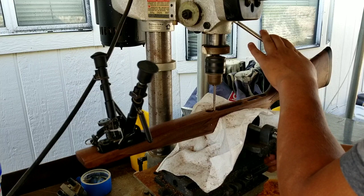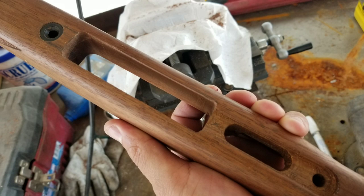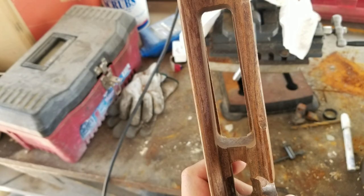Utilizing the drill press stop, I set the end mill to bottom out where the steel spacer used to be. From there, once the material is all removed, I started doing some facing, working towards the outer edges. You should end up with a nice square clean cut with a smooth face. As you can tell, it did not entirely follow the outline, as the magazine well is tapered.